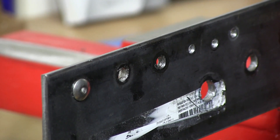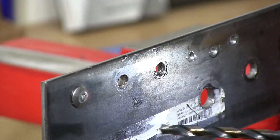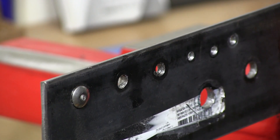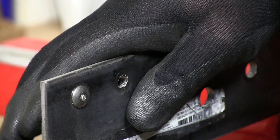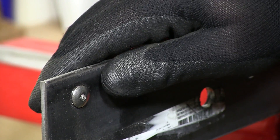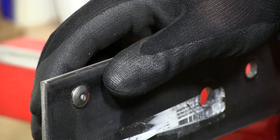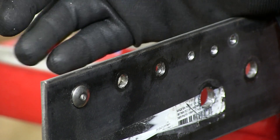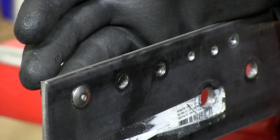It takes you less than 5 minutes, not even a couple of minutes. You can drill the rivet right out. So if it's a quarter inch rivet like we used here, you should use a quarter inch bit to remove the rivet or a 3/16 bit. But nothing smaller than that and nothing larger if you don't want the hole to be oversized and you're going to reuse the hole again. You basically want to use the same size as the rivet that you originally installed.